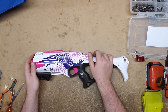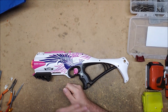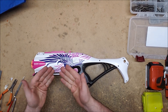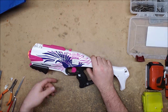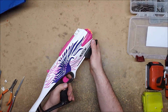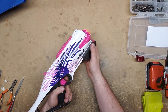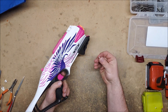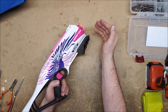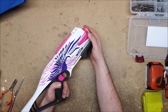I fixed it by drilling a hole through the worn nub, putting a screw in there, and filing the screw down until it was the height that had worn off and needed to be replaced. I also took out the slide lock spring — the one that prevents you from priming after it's already been primed — and replaced it with a slightly weaker one, because it was causing undue friction on the arm that slides forward, preventing it from completing the full rotation.